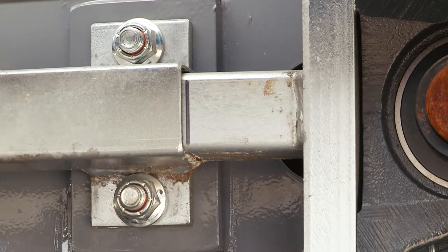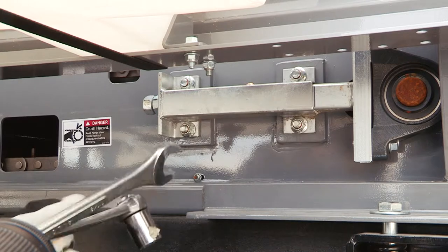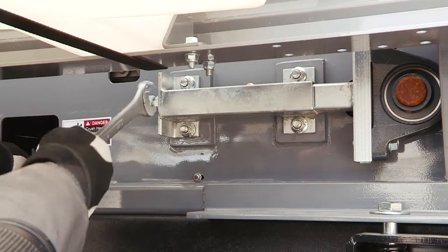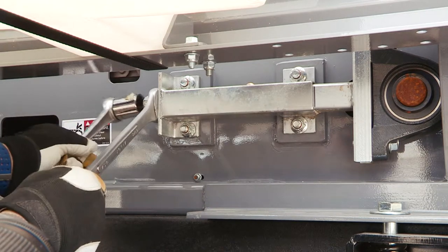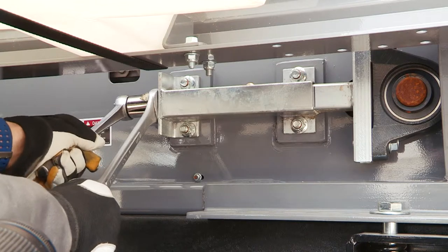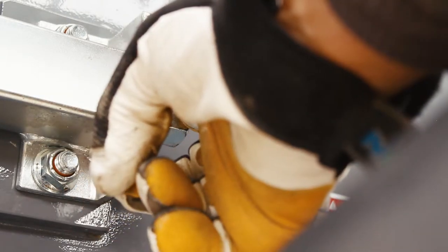So we have them both at the same distance. We just made our movement, measured both sides, and we are equal. Now we're going to lock down the locking nut — pulling out the adjustment nut and making it tight. Like the other side, we're coming back over to the operator side and tightening down the locking nut, holding this adjustment nut, and locking this down to the case.